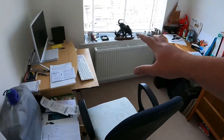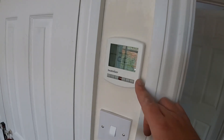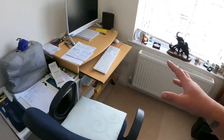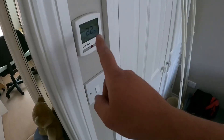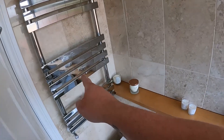Let me take you up and show you what's going on with the rads. We'll use this room for example — we've got a rad here with a thermostatic valve on it. You'd think it's just on the heating loop, but we've got an underfloor heating style touch panel here. If we turn this up, this rad gets warm — so obviously there's an actuator under the floor feeding that rad. Same again with this one: turn this up and this rad will come on.